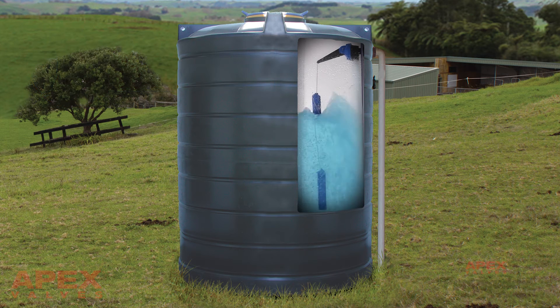Operating principle. When the maximum water level is reached, the Apex PumpBuddy Valve shuts off and remains closed until the minimum water level — when the bottom weight is exposed. The Apex PumpBuddy Valve then continues to fill the reservoir or tank until the maximum level weight is reached.